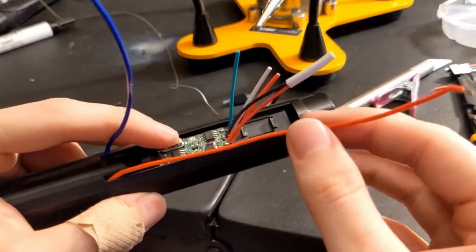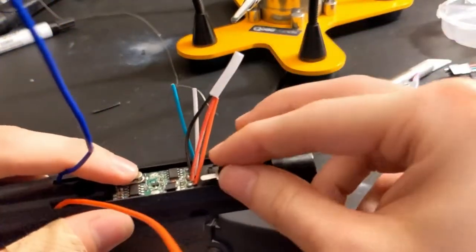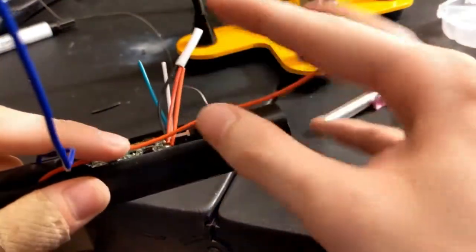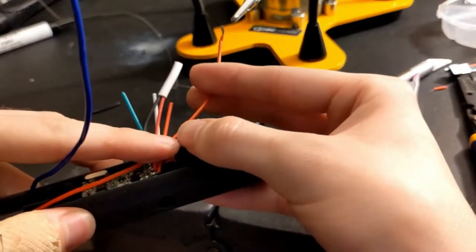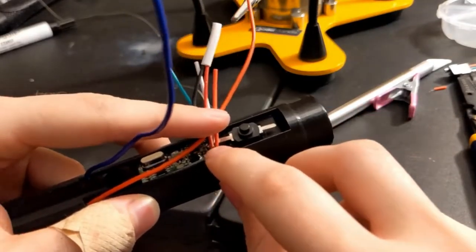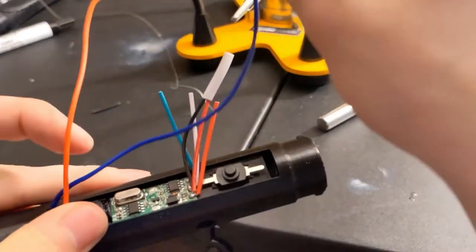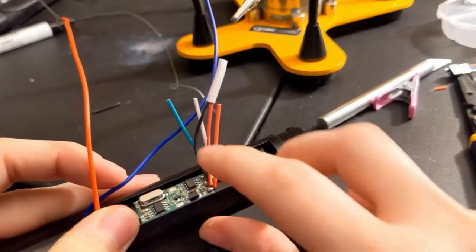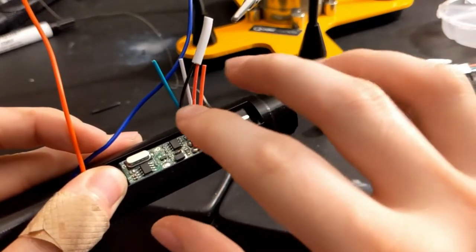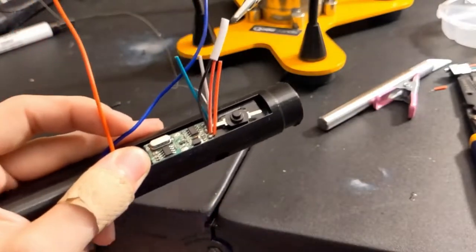We're going to take the power battery lead and connect it not to the microchip, not just yet. We're bypassing the microchip and connecting directly to the toggle switch. The toggle switch can then be turned on and off, which allows the power to be disconnected or connected, and the power from the other end would then be rerouted back to the power on the microchip board. The negative battery lead will be connected to the negative grounding lead on the microchip. And from there, the power leads and the logic connection wire will all three be routed to the LED strip, which would be this end. So let's go ahead and do that, shall we?